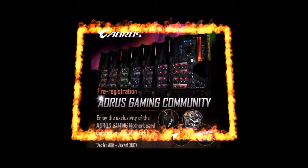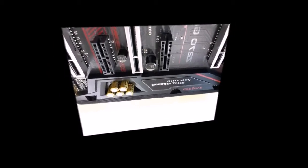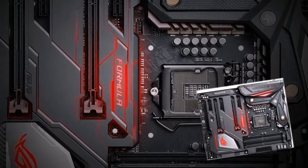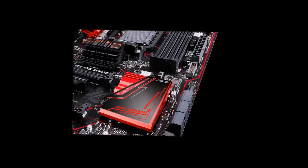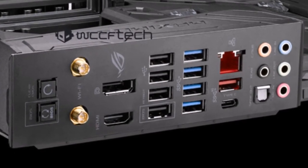The following two boards also feature a Wi-Fi adapter, 802.11ac 2x2. The ATX motherboards ROG Maximus 9 Formula and ROG Maximus 9 Code are, in fact, one product with different means of cooling the transistors of the power system. The Formula version is endowed with a channel for fluid flow in the VRM radiator, but the Code itself does not have this. With the exception of these small differences, the two boards can be considered as alternatives to the Extreme model.